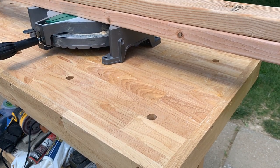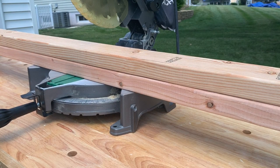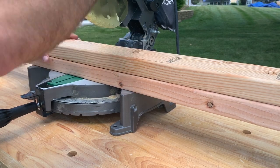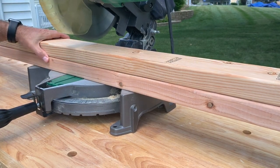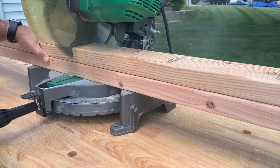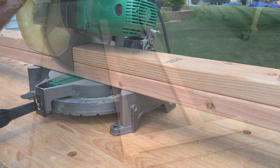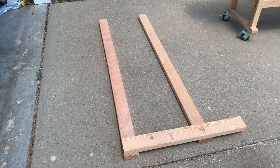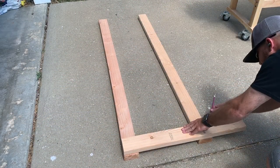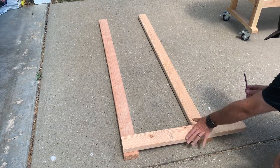When it came time to build the ladder, I started with the long edges — the rails. I stacked them on top of the miter saw together so I wouldn't have to measure and try to get the length exactly the same. I cut through both of them at once after matching up the ends so they were exactly the same length. Then I laid those two out and put my rungs across them so I could mark the placement.